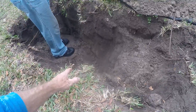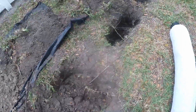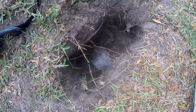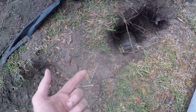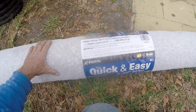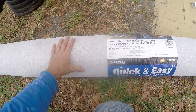Out here you can see how deep we're getting — we're down there knee-deep or so. This has to run downhill. Remember when I showed you where the chamber is? He's plenty deep enough right there. You can see that water — it's right at the bottom, maybe about halfway up the chamber. So we're going to drill a four-inch hole into the chamber, let that water come out and go through this Easy Flow drain — I guess it's called Easy Drain. This is just four-inch pipe surrounded by styrofoam peanuts, and basically we're giving that water a place to go.